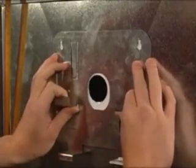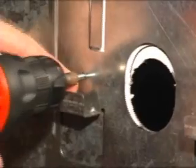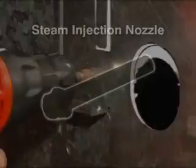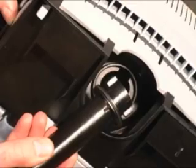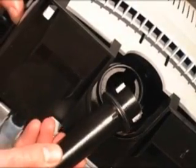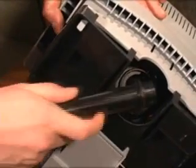Position the mounting bracket over the four drill holes marked on the sticker and secure the bracket to the duct using the number eight screws provided. A steam injection duct nozzle is included with the True Steam humidifier. Remove the cover, connect the nozzle to the patented condensate collection dome, insert the nozzle and twist clockwise, making sure the nozzle's gasket seal is properly seated.